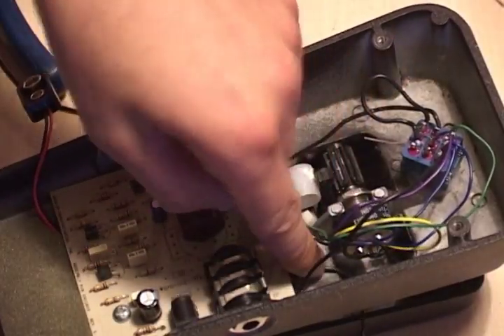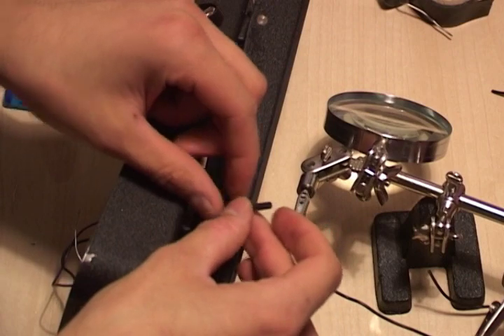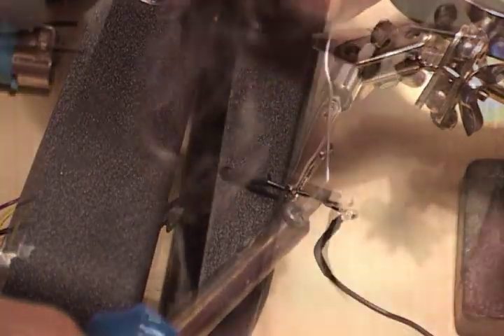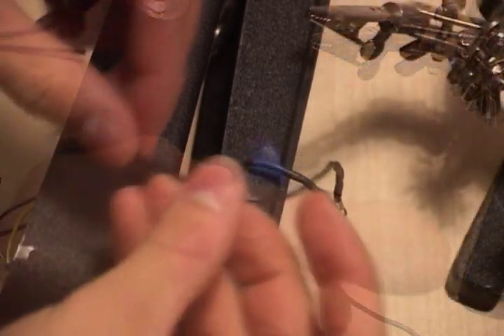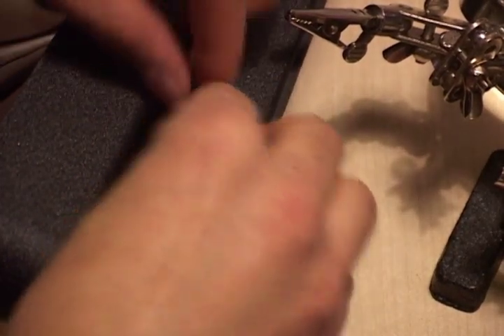Now we are going to take the other wire that we soldered onto the PCB from the resistor and thread it through the chassis of the pedal, then through the hole on the side of the pedal. Now you can snip any excess cable off. Slide a small piece of heat shrink over the wire and push it down as far as you can to avoid it shrinking near where you are going to solder. Now you can solder the wire running from the PCB from the resistor to the anode or long leg of the LED. Now slide the heat shrink from further down the wire over the exposed metal. Now thread the wire through the hole and into the main chassis of the pedal.